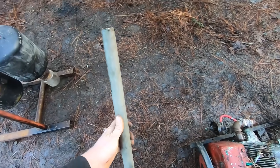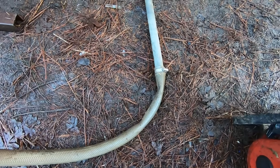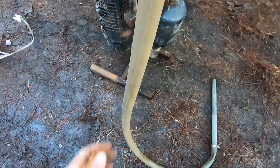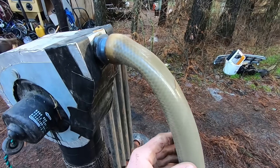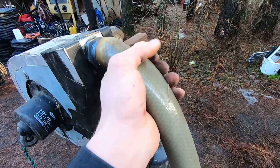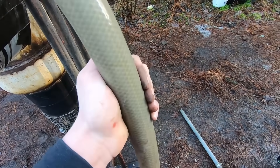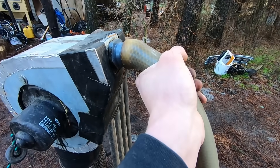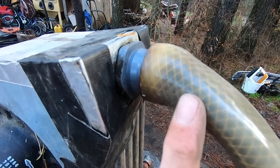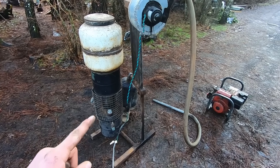The reason for the metal pipe section here is so I can light this on fire without burning the tubing. The rest is just clear braided hose from my local hardware store. I was worried about how corrosive the gases would be, but in the couple of years I've had it and run it quite a few times, there have been no issues — it doesn't feel brittle and is still soft. This is just a barb the size of the hose that I threaded into the sheet metal. Now we're going to start it up and try to run that generator.